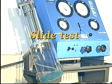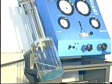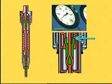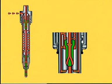Increase the pressure to about 50 bar below the opening pressure and then move the control handle to the closed position. The pressure will gradually drop to around 15 bar, whereafter the slide on the non-return valve will open and the pressure will drop very quickly to zero. If the quick pressure drop cannot be registered, the slide is sticking or the hole is blocked. Disassemble and examine the parts, and replace if necessary.